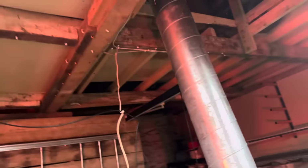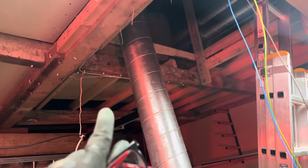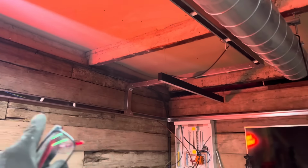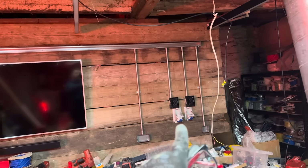So I've got to get rid of all this old wiring, I've got conduit run to do all the way along there to pick up 1, 2, 3, what will be a fourth light fitting, then 4 light fittings on the conduit run diving into the trunking. Wire that. I need to wire, there's a socket there, there'll be a socket in behind for the television, and there's also gonna be another socket there. I've got a 32 amp 16 amp feed there. I need a lighting feed at that one, which is then going to dive out through the back for light fittings in the corridor behind.